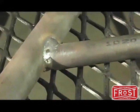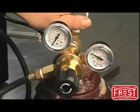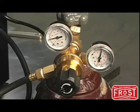The unit can go from 20 gauge up to 3/16. These are true MIG units — they use solid wire and a mix of 75% argon and CO2 gas. What the argon does is displace the oxygen in the weld pool to eliminate any impurities during the bead.